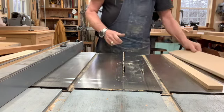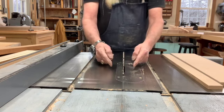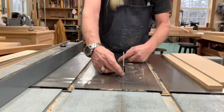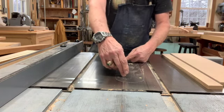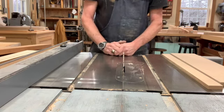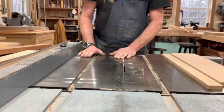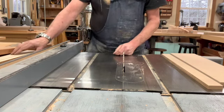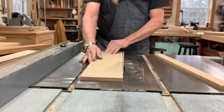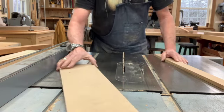The first thing I want to establish before we talk about actually ripping something on a saw is that the blade itself is what dictates what we're going to do. The blade spins in one plane and it does not compromise — because it's anywhere from six to ten inches wide, it can't cut curves and it cannot tolerate material moving in a curve through it or around it. That's inarguable. So that means the requirement is that the material we're cutting must pass in a path that is parallel to the plane of rotation of the blade. It is inarguable. There is no exception.